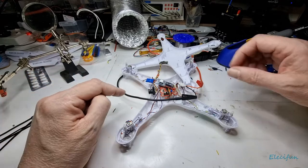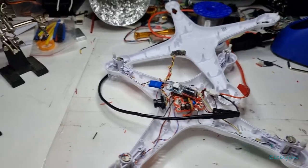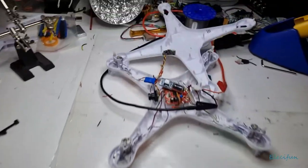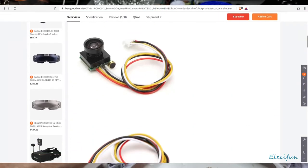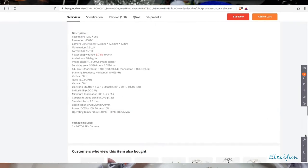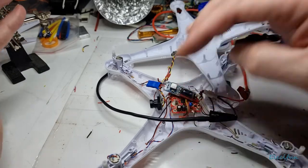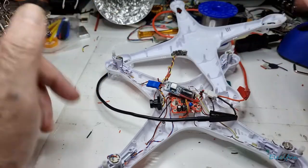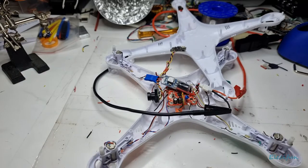There's a slight tilt down on the camera. The reason is: one, I can adjust it by warming up the hot glue; and two, I've got to have it slightly down because it's not a great camera — it won't have a wide dynamic range for sorting out brights and darks. The sunlight will make everything go dark on the floor very quickly. A lot of cheaper cameras do have a tilt-down because they can't handle the sun. When you're flying quickly it's alright, but when you slow down and it all goes dark — no good.